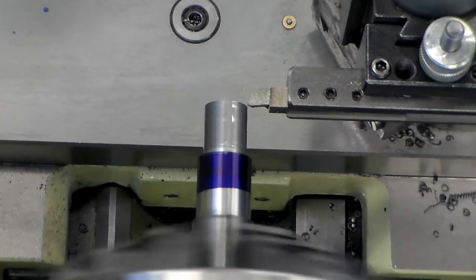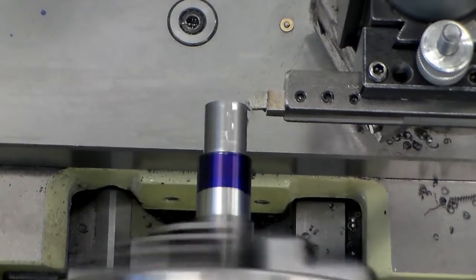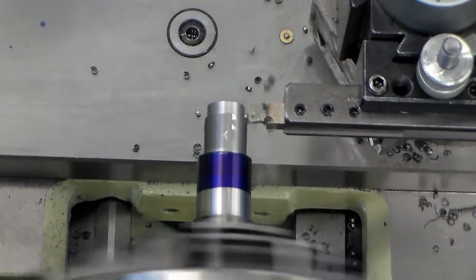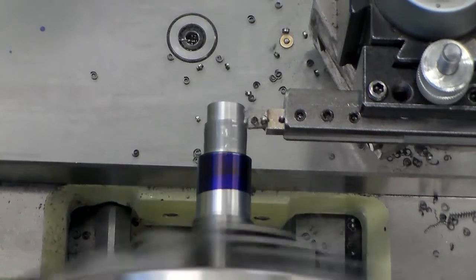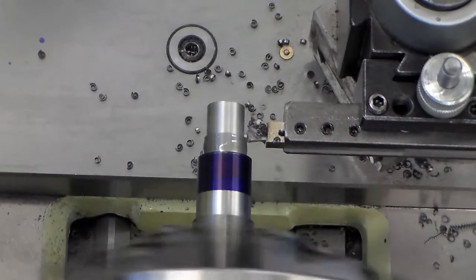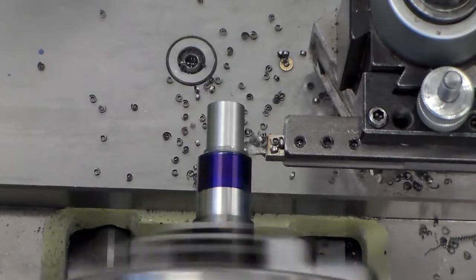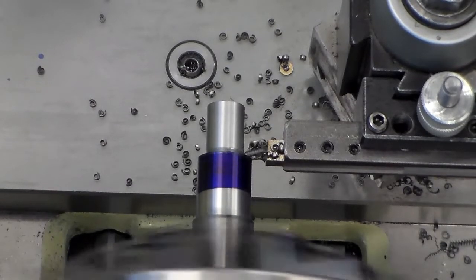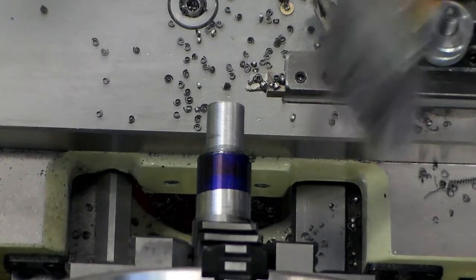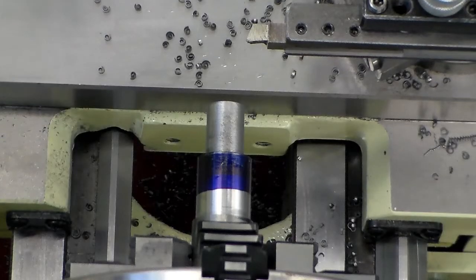In this pass we should see a shallower depth of cut. I actually just realized — a few seconds ago I said this was a .750 diameter but it's actually a .625, so I misspoke. That is another pass of a hundred thousandths. After this pass I would have roughly seventy thousandths until finished, so I'm going to dial half of that remaining because we want our last two cuts to be very similar in tool depth — that establishes even tool pressure, which means somewhat predictable tool deflection.